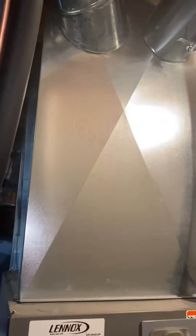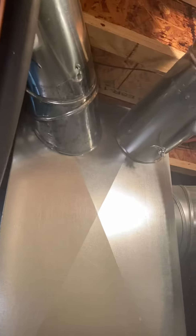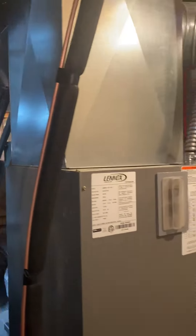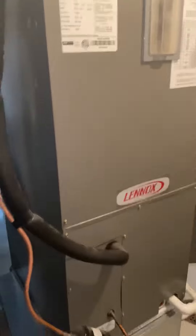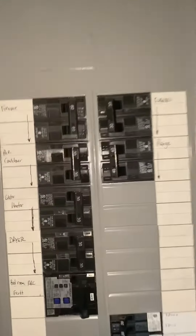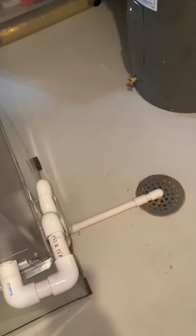There's about 23 inches from the top of the air handler to the bottom of those supplies right there. We wouldn't replace the return drops — just looking to slide in the new air handler. Heat kits are a 25 and 50. There's a double 30 breaker right there, and the drain line for everything is sitting right next to it.